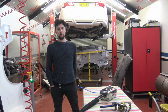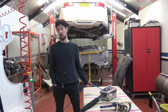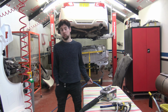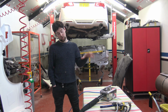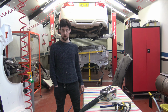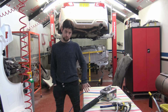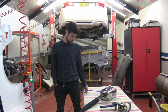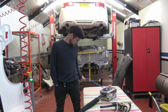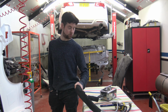So this system was designed to be compact and lightweight for all users, whilst allowing for the independence of awkward tasks that can arise using a standard single-phase spot welder. Users are required to clamp the metal by squeezing their hands using an ordinary single-phase spot welder, and the transformer is also in the unit, in the clamp. This is different, this is separated. It was an experiment to see how it would work. It does work very well.